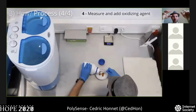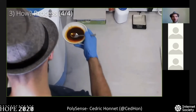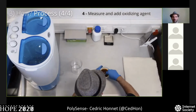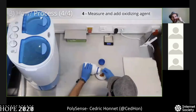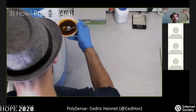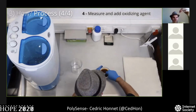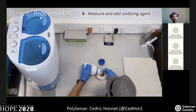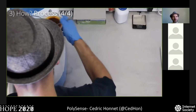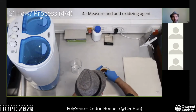But concretely, if you want to make piezoresistive sensors, the ones that measure pressure, about half an hour works most of the time, maybe 45 minutes for synthetic materials. If you want to make capacitive sensors, like the big one that I was showing earlier, that was several meters, 2 hours is really the minimum. In our case, we were making several meters, several yards of this textile. I forgot, it was maybe 6 by 10 or something like that. And we folded it, so it's not obvious, but it's actually a lot of textile. We did several machines of this, several nights, every time one night of polymerization. But basically, the longer you polymerize, the better the conductance will be.